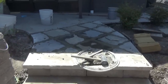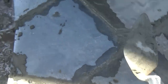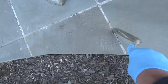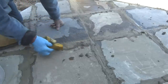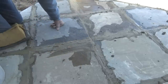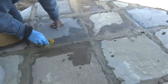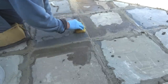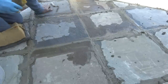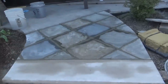I'm getting done up here with the patio. I've got all my joints in - it's all Portland, no mortar. Over here it's all this mortar and it's all falling apart. It doesn't work in Pennsylvania. When you're working with Portland, the water comes to the top, so you've got to start cleaning the top up until the water goes away. It's drying up, we did our first run through. We're going to go back and do it a second time.